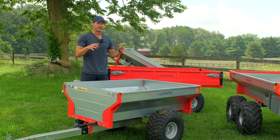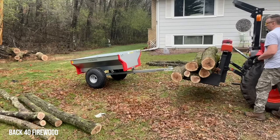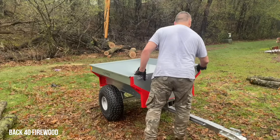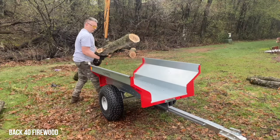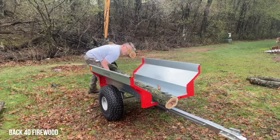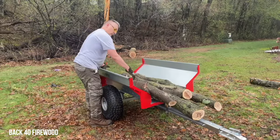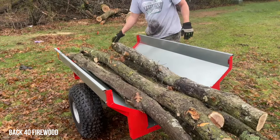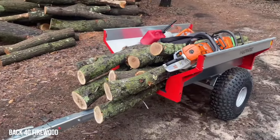For tractors, these weights — the 1,500 pounds and the 3,300 pounds — are likely just fine even for a subcompact tractor. You still want to always maintain the right tongue weight, just like a truck going down the highway: if you don't have enough tongue weight, you get that fishtail effect. You can also take too much weight off the rear axle and lose traction. On some of the smaller ATVs and UTVs, you want to be aware of how much weight you can actually pull behind those machines. It doesn't mean you can't get one — just be aware that maybe you don't fill it all the way if you're on a smaller machine.